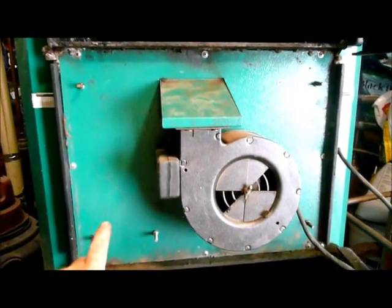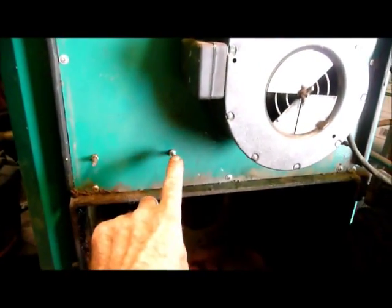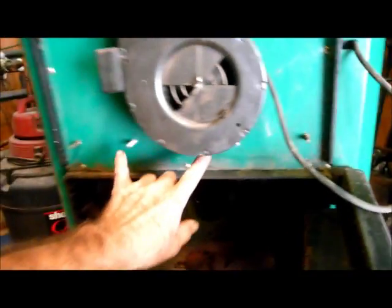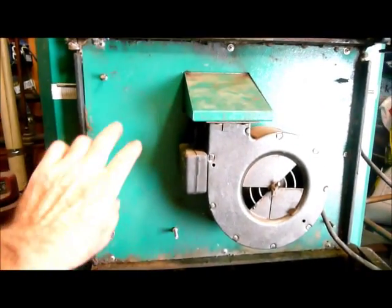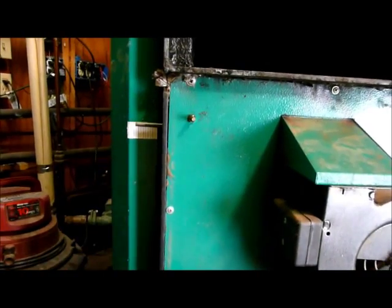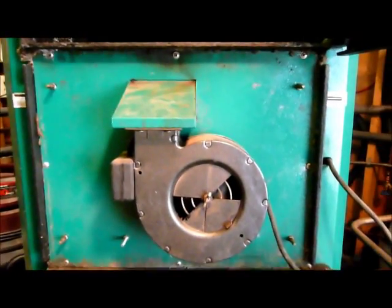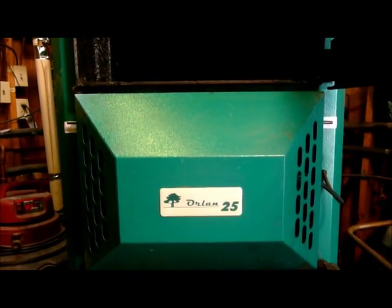Here's a view with the blower cover installed. Here are the screws for the secondary air adjustment — there's one there and another one there. These come from the factory so you can change that adjustment. But for the primary air, you'd have to remove this cover every time and shut the stove down, which is a pain. So there are the screws for the primary air, one on either side, and there's your secondary air adjustment. Should be a lot easier. There's the shroud installed and it's all back together.